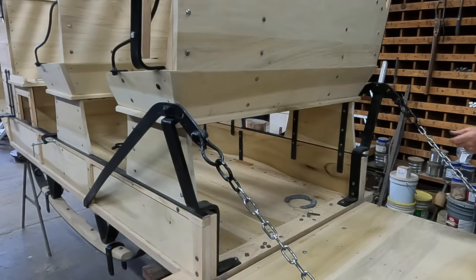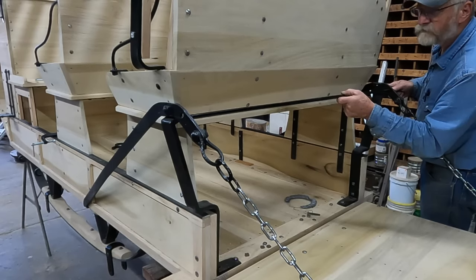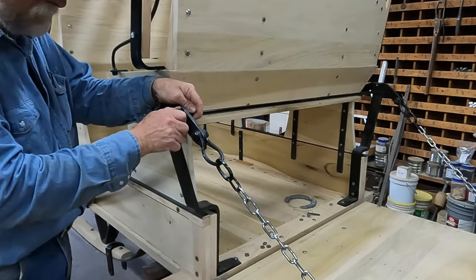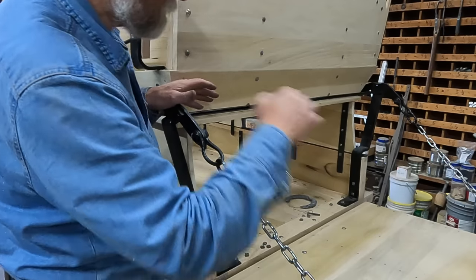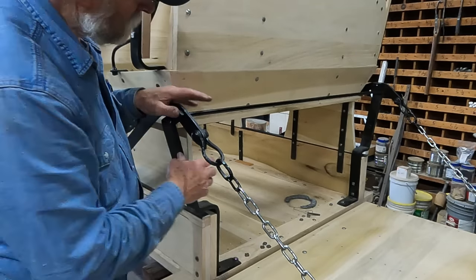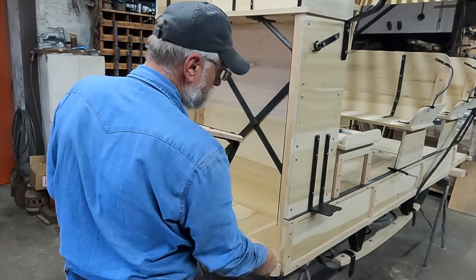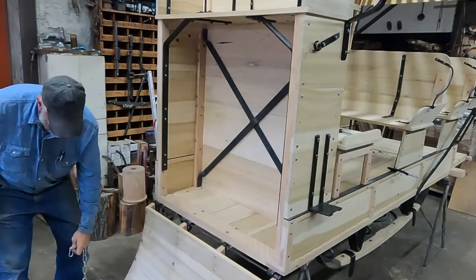Now another thing, and you're all going to remember this once you see it, there's a half-inch rod that goes across the back that will carry the cover over the luggage boot. So if this is a typical boot, which I'm assuming it would be, there'll be covers that hang on these chains, and then a cover that'll come up over top, fairly long, so it can be raised up over the top of the luggage. And I'm speculating maybe possibly a drop cloth here to keep dust out of the luggage. I'm going to drop this driver's footboard to the front driver's boot, get it down out of the way.